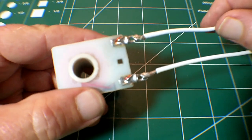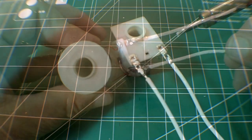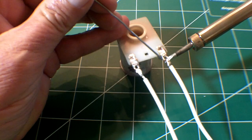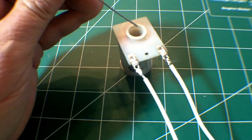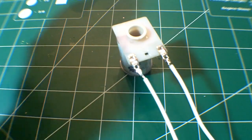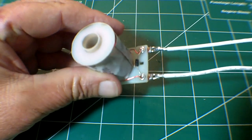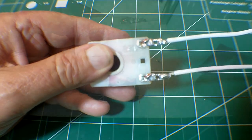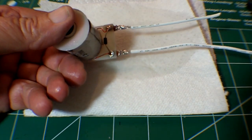Inspect the back side of your solder joint. If there's not enough solder, reheat the joint and add a little more. Just for grins, we'll add a little bit more solder to this joint. A good solder joint is smooth, shiny, has no pits, scratches, or jagged edges. Always clean the area afterwards with a good flux remover.